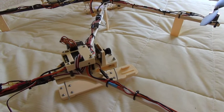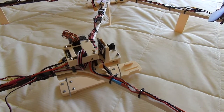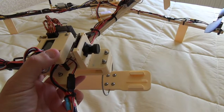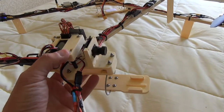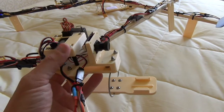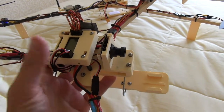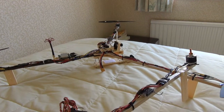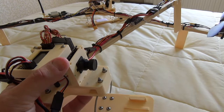As the PLA gets older and more worn it tends to break down a little bit, so eventually I need a better system for tightening it. There's a lot of hardware on there as regards nuts and bolts — I'd like to reduce the amount and hopefully replace those with zip ties. I need to sit down and work out a better design of how it all goes together. The KK board case isn't mine — it's something I downloaded from Thingiverse — and I don't really like it. These hexagonal upstands are about 15mm and just too high.